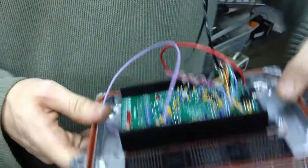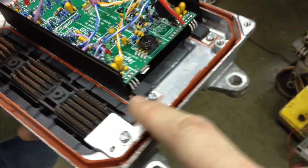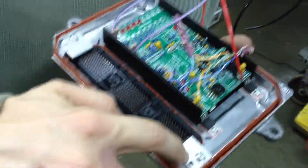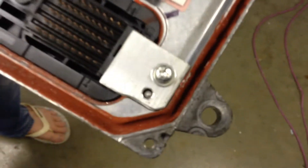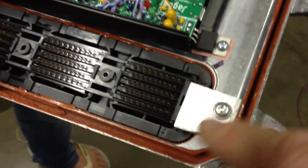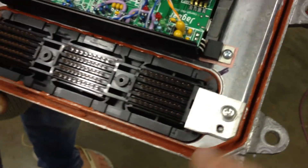So these two screws are holding it in. These two screws hold this piece of black case, which is sort of ghetto rigged, if you like. So this is an entirely separate protobox that's been nested inside this aluminum ECU housing. That's right. These tabs I made earlier to hold the connector in place, because usually it's held by adhesive and the circuit board. So these were aluminum 1/8-inch thick sheets that have been drilled and then filed on the sides to fit this case.